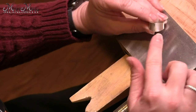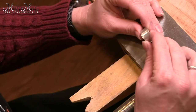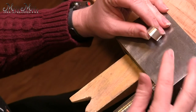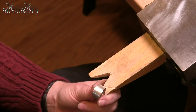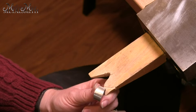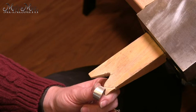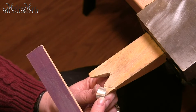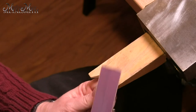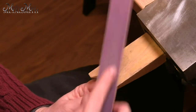What we're looking for is a seam where, if I hold this up to the light, I should not be able to see any light come through. I'm going to spend just a second cleaning this up and making sure it's nice and flush before I solder it closed. I'm very happy with how my seam looks — it's closed nice and tight. I'll take a little bit of sandpaper and go over this seam just to make certain everything is nice and smooth.